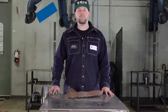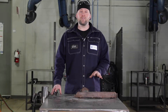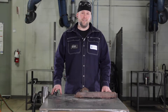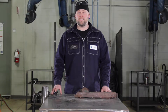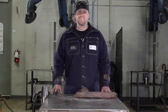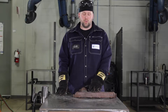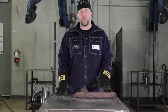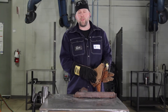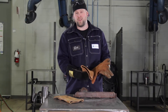Step nine, we are going to slow cool our manifold. You don't want to let your piece cool too quickly, so you'll need to slow cool it. You can put it in sand, you can wrap it up in welding blankets. In my case, I've got some old welding gloves and some old welding jackets. The reason we want to slow cool is that these two materials cool at different rates and we want the best chance at success. You never want to shock your cast part — what I mean by that is any cold air or putting it on cold concrete. What I'm going to do is wrap it up.